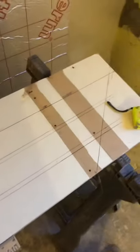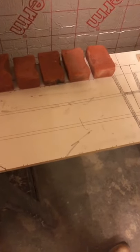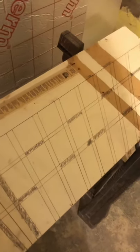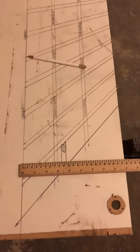Once you've done that, the rest can be divided out to calculate it. I've done the calculation — it worked out to be 8 bricks. I had some bricks laying about so I just sat them on there, spaced them evenly apart, and there are 7 joints in there. So off the bottom, minus 70mm, I measured it as about 370mm — about 300mm left, divided by 8. Then I measured that, marked out a 10mm joint, and joined them all up together to get this, with every other mortar joint stepped like that. On the last course you need to drop the mortar joint down a bit or you won't be able to get the last section out of one brick — here I've done it at about 85mm and 95mm, and that's the mortar joint.